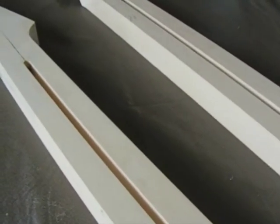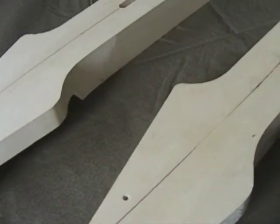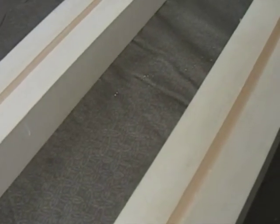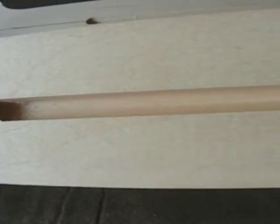Now let's have a look at the finished product. Here are the two necks — one with the headstock adjustment and one with the heel adjustment nut. Just a couple of camera sweeps of the truss rod routes we've just finished. You can see the center line is nicely lined up with the route, so everything should be nicely in line once I do my end hole drilling. The route is nice and clean with no wobble, thanks to having those rails tight against the disc of the router base — it keeps things nicely in line and you have fewer problems with things moving around.